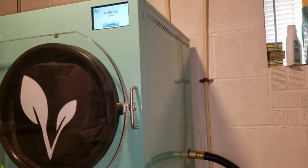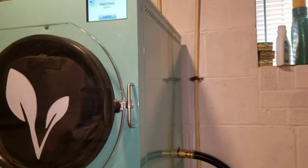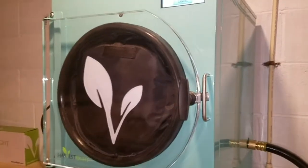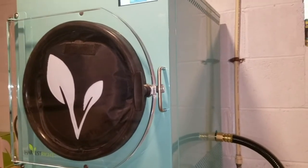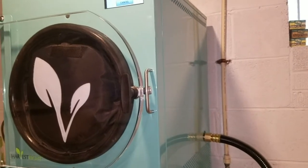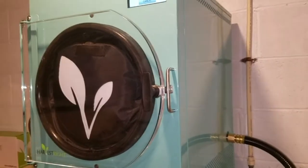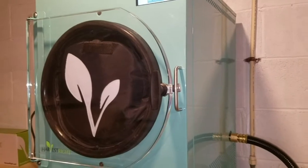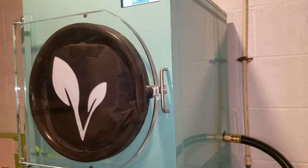The other thing is code. For a basement in North Carolina, the NEC code says you have to have a GFCI over there. Some people say it's a problem, but like I said, I buy industrial grade. It's only like $1 more. And in reality, this thing shouldn't trip a GFCI, a ground fault. That means there's something wrong with the machine. It's not a breaker, so it shouldn't trip because it pulled too much power. Now I think these things run about 16 amps on peak, 16.3.